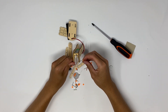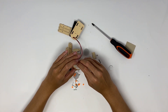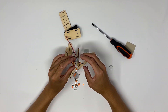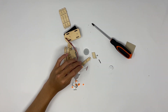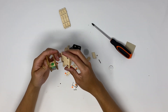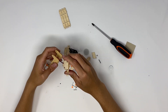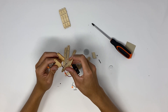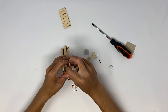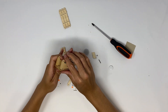Put two orange rubber stoppers onto the rod — this stops the bar from sliding around everywhere. Once you've done that, take the top plate of the robot where your battery pack is attached. Line up those four holes on the top plate with the four cutouts in the legs and securely press them in. Make sure everything is nice and tight.